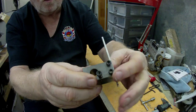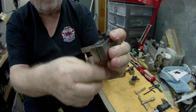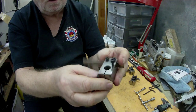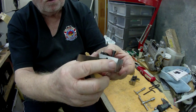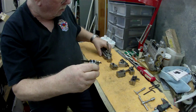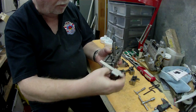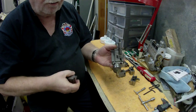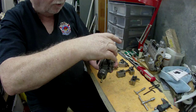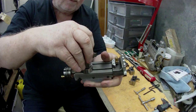It's basically a block with a hole in it. It's split down through the center at one end, and there's a locking screw on this face. When you have it on the lathe, with the handle facing you, this just drops down and you have your adjustment for height.